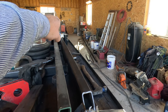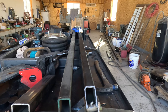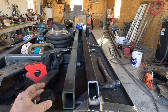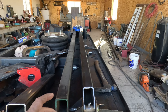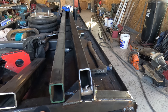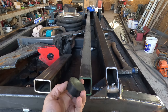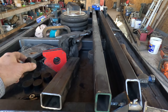I'm going to make it adjustable, just like I did on the other end with the rollers — it'll have a bolt-in adjustable hingeable piece with the foot on it. I don't want rollers on this end because you don't want the lift rolling around; you want some stationary activity there. I'm deciding whether to go across with the rubber pads in a simple straight foot or in a triangle shape. These rubber pads are really hard rubber — I just have to drill through them and they'll thread onto a little stub. You can buy replacements at the hardware store.